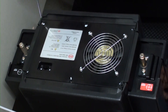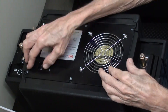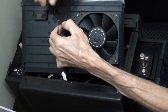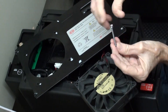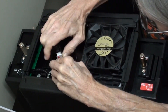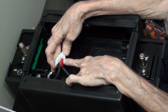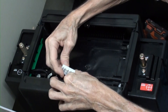There are six screws holding the cover on the front of the battery and two screws that hold a socket there. I'm removing the fan, which is very loud, and the original battery management circuit and pretty much everything from this little compartment at the front of the battery. You can see more about that in the previous video where I go through all the details of making a battery like this as a power wall for my house.